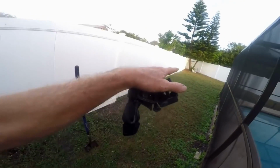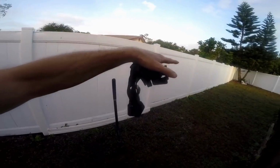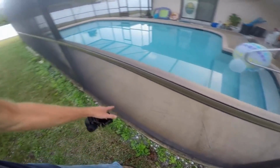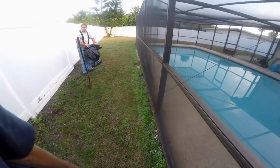Water has been collecting in this low spot from not only this yard, but the yards behind her as well, and it just pours down through here, and of course it's been eroding underneath of this, and this is going to crack. It already has cracks in it. We want to stop that. So this is why you need to put this drain in.